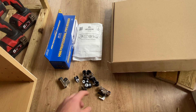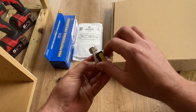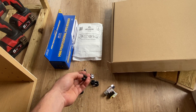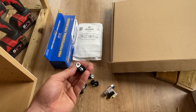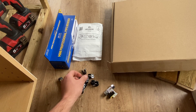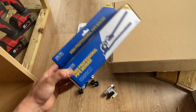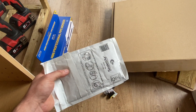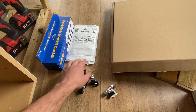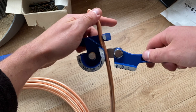Here are a few of the items I'm going to be using. Here I've got my local gas isolation valve — it's just a little quarter-turn ball valve. I've got some P-clips for supporting the pipework, and the pipework must be supported at a minimum of 500mm intervals and 150mm either side of a joint. Here I've got the pipe cutter, mini pipe bender, and I've also got some copper olives because they're softer than brass ones so you get a better connection. And 10 meters of 8mm copper pipe.